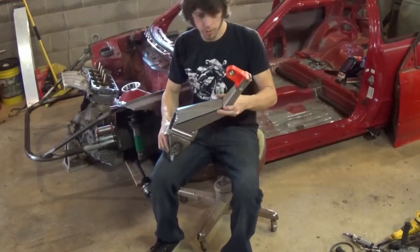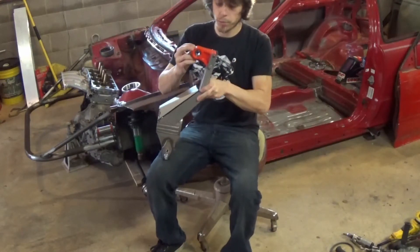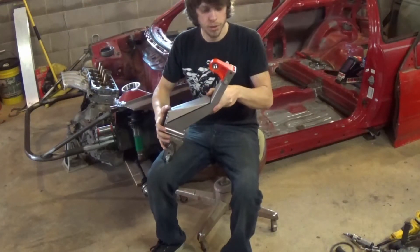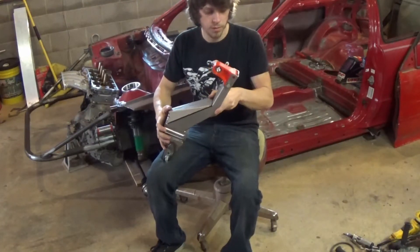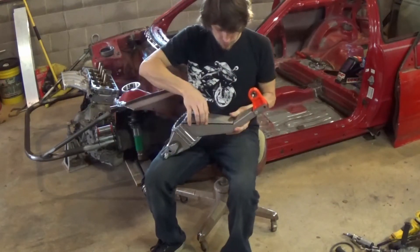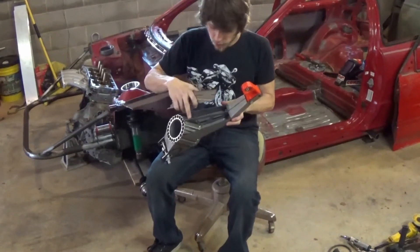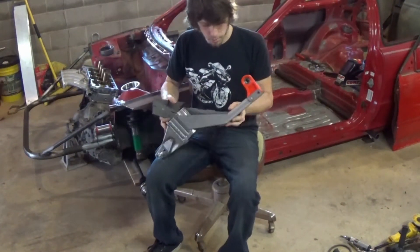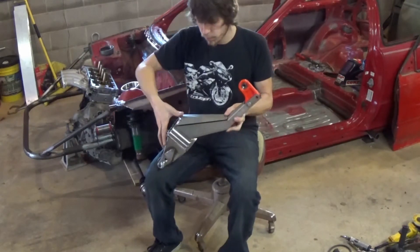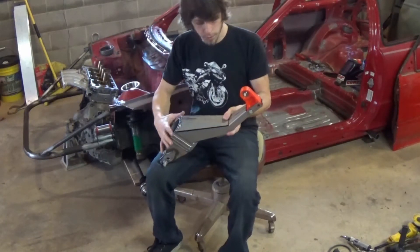The spindle is further along from last time. This is a 3D printed mock-up of the upper ball joint piece — it will be machined aluminum, but before machining I want to make sure everything fits, clearance is good, and geometry is correct. Right now we just have a couple of tack welds, but there's an inner structure and everything keys together to properly locate it. Once welded up, the key pieces help with strength.